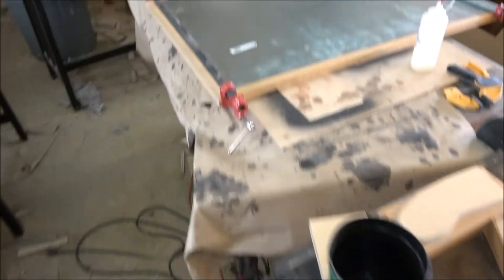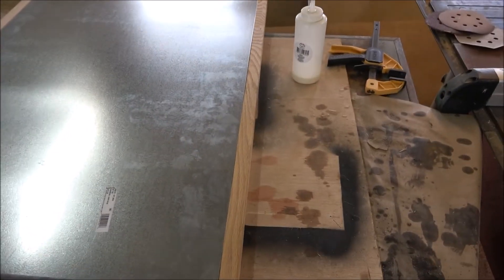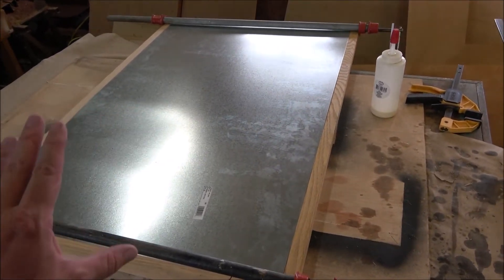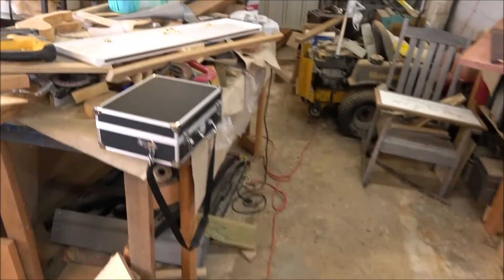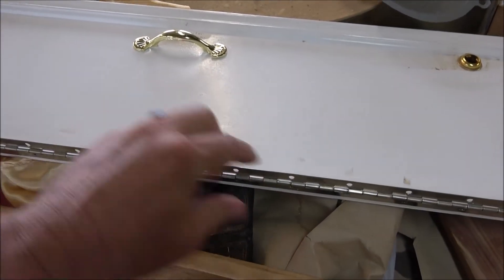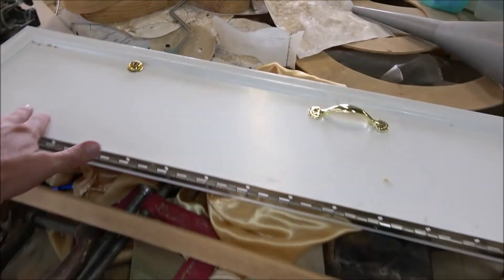To give you an idea of what I've been working on today: this is a piece of steel, just a 16th-inch plate, and you can see the wooden frame that I've got gluing up around it. The steel still isn't passing down — I can still pull it out. But what that is, is to fit beside a wall, beside a refrigerator, so people can put magnets up and notes and whatnot. The other one I'm working on is a cabinet door for my church. They have a big piano hinge — the door folds down — and the piano hinge ended up splitting the wood it was on and just falling off. So I'm fixing to reconstruct a piece of wood that will go underneath so it can connect.